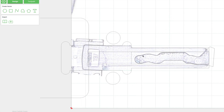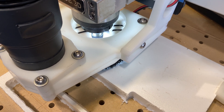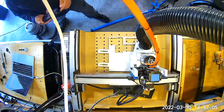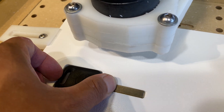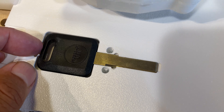I'm basically making a fixture to hold the new key while I cut the pattern from the old key. Since they're in one project, they'll be exactly aligned. This is the holder — see how it fits. I'm going to tap those two holes to really lock the key down so it doesn't move.